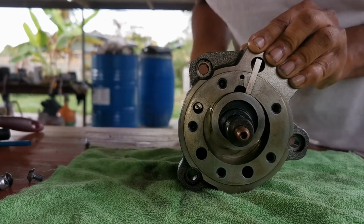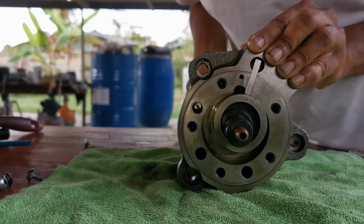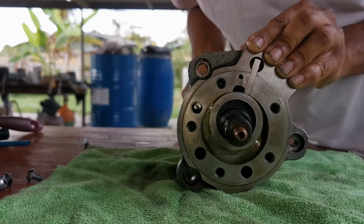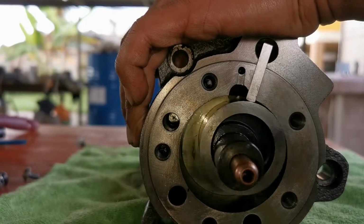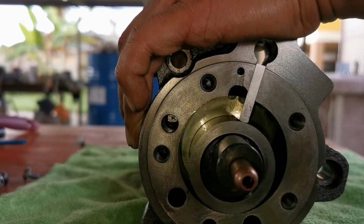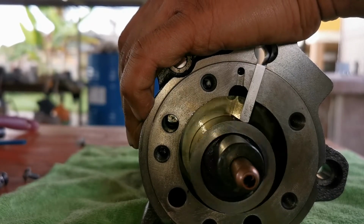As the rotor moves, it creates a void where refrigerant is pulled through the suction port. This void progressively increases along the rotor's revolution within the chamber. The sliding vane separates high and low pressure regions, maintaining its seal with the stiff progressive spring load keeping it against the rotor's outer circumference.